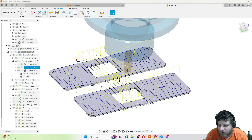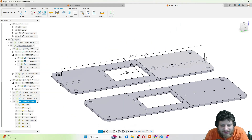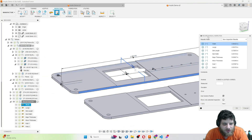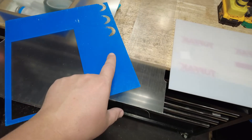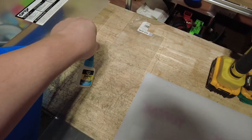That time estimate also includes our inspection plan. So when I'm inspecting these parts, I can just hit 'Record Manual Inspection,' type in all the different values, and this will generate an inspection report I can ship to my customer. So how do we hold this stuff in the mill? My answer is still superglue — superglue is still the key for these small thin parts, though I've changed up my process a little bit.